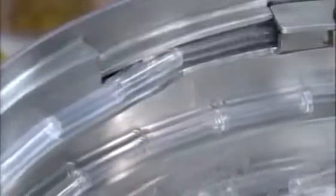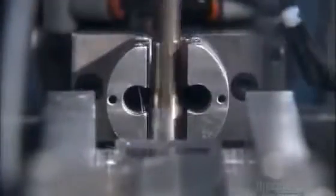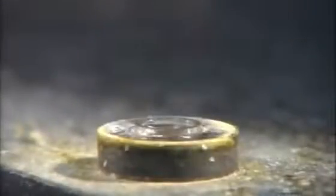The vials wind their way through a vibratory feeder. It takes them to a gripper that rotates each one so the open end faces up. It's time for a fill-up with yellow mineral spirits, leaving just enough room for a bubble to form. A robotic arm plugs the vial with a plastic cap. Then, this sonic welder applies high-frequency sound waves to melt the cap onto the vial.